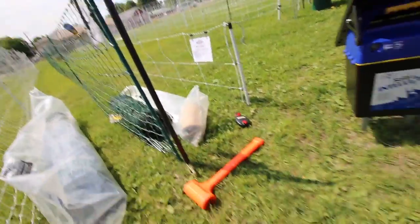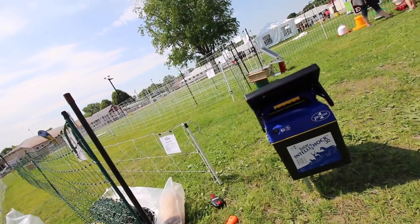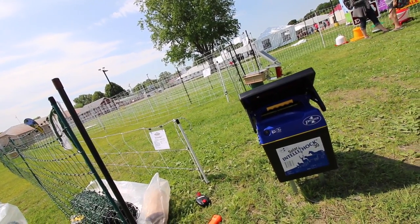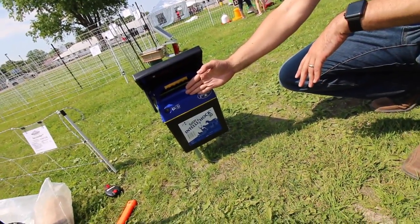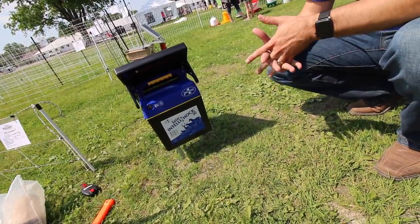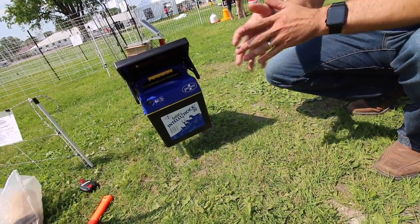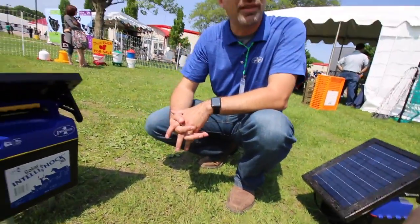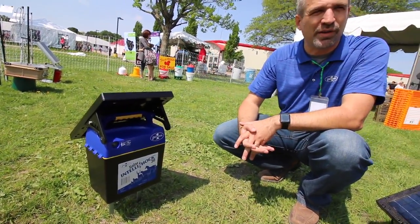The other thing is along the fence line, you want to try to keep the grass off that bottom strand. You need more energizer power to handle that weed load, or you need to control the weeds — either with herbicide or a natural approach like a strip of vinegar to kill the grass. You can also just keep it mowed or weed-whacked down.